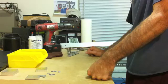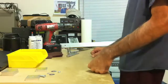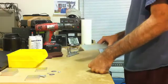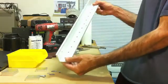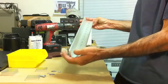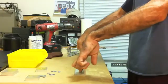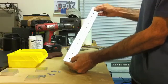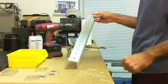I'm looking at pieces that are a quarter inch to three-eighths thick and I don't really need that inside my shack — I just need a simple grounding point, so I'm going to build one on the cheap. I have a friend who does fabrication; I used to work with him doing aluminum and stainless fabrication. He still has a shop at his house, so I grabbed a nice piece of inch-and-a-half by inch-and-a-half aluminum angle. I've already drilled the holes — two holes to lag it down to the bench, two five-sixteenths holes on the outside to use as clamps, and then 11 holes for grounding locations.